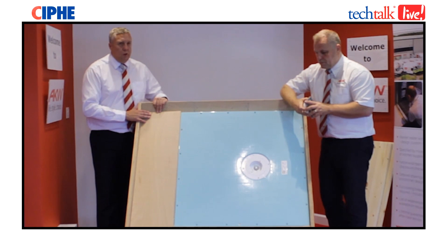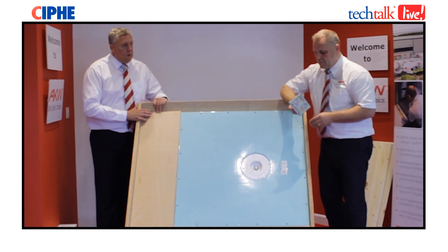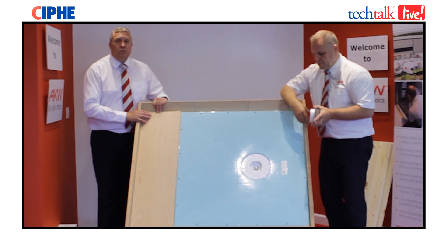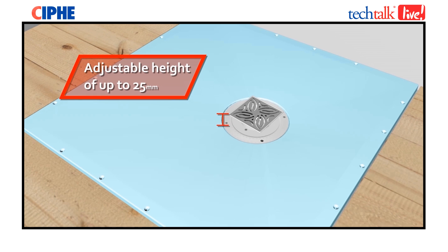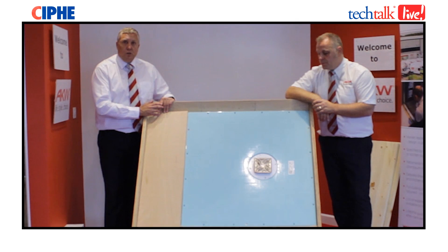Now everything is inserted, it is time to insert the waste. This is for a tile installation, so the waste can actually be placed inside and adjusted to suit the height of the tile required. Alternatively, there is a different waste procedure if you are going to use safety flooring throughout, to give you a slip-resistant surface throughout the bathroom area. That adjustment will allow you up to 25mm depth in tiles, so the tiles will go right up to the edge and the fall of water from the tiles goes straight into the waste and away to your soil pipe.